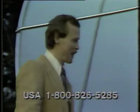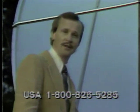That's the reason for the super smooth surface, creating the most accurate surface possible in an antenna on the market today. The parabolic reflector itself is a one-piece, eliminating the time of assembly and also assuring you of maximum parabolic efficiency. The surface of the microwave reflector is a satin finish, eliminating the need for painting or putting a finish coat on the surface itself, which will eliminate any need for any future maintenance.